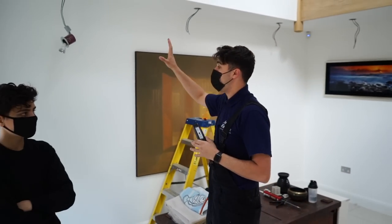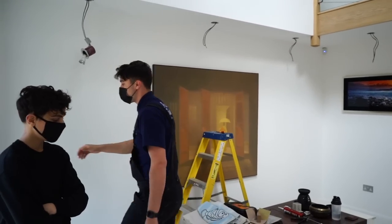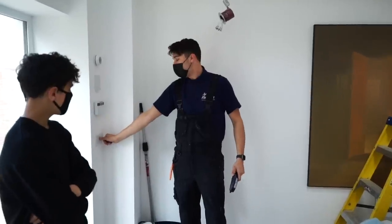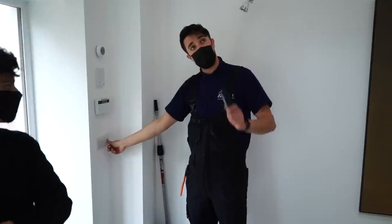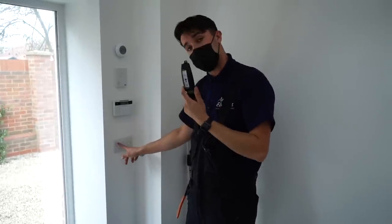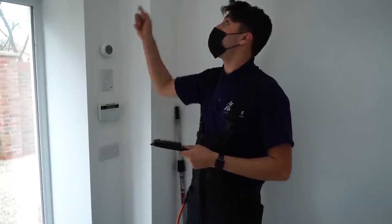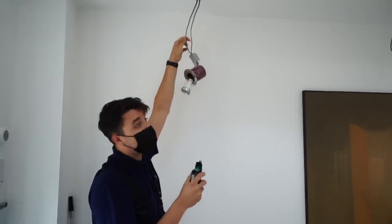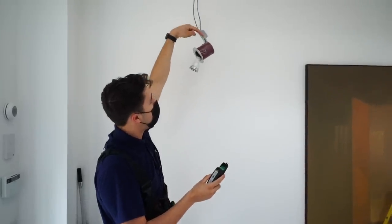For every leg of every circuit, you'll need its own dimmer. In this situation we have a light switch here - safely isolated currently - and each switch has a feed from the consumer unit, with each switch powering a different branch. To make these work individually, each switch needs one of these inline dimmers. We have to find the first point from each switch, and from the feed in from the switch, we feed into the Lutron controller, with the feed out going into our new light fitting.